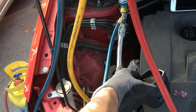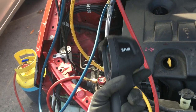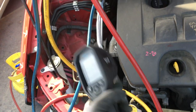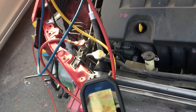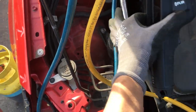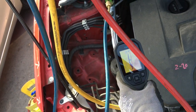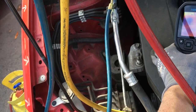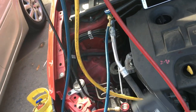Temperature-only laser guns with no camera give you wrong readings when you switch from black to shiny silver surfaces. Non-contact laser temperature sensors will give you a reference and show you that something is happening, but if you're going for accuracy they are not accurate on shiny bright metals, especially rounded items. If you have a heat source like a hot valve cover or exhaust manifold nearby, a thermal camera will pick up that reflective temperature — an item six inches away can reflect heat back into the sensor at the right angle and give you the wrong reading.